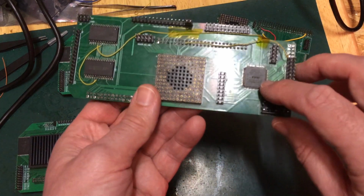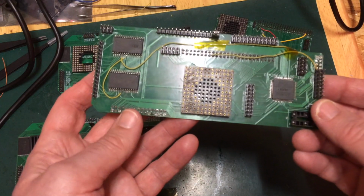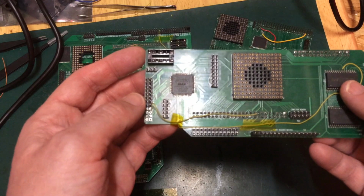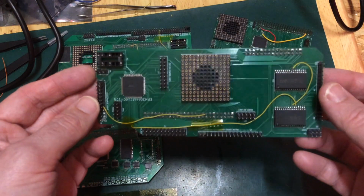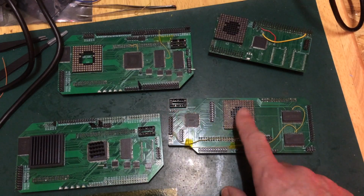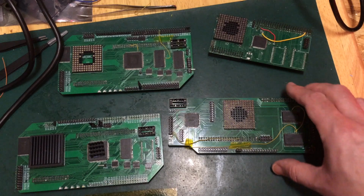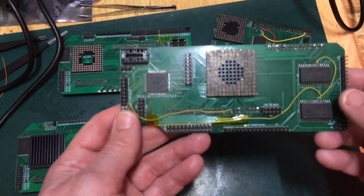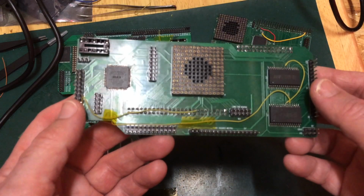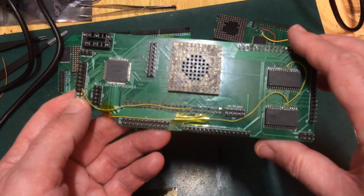When I designed it, I hadn't realised it was discontinued, and I really struggled to get the chip in the end. So this one was of limited future development anyway, but this introduced an external crystal, main CPU, still had the two static RAM chips there. I think this is a grand total of 1 megabyte of Alt RAM, but it was just for experimentation. And you can see there's a few bodge wires and things, but this one did actually work.